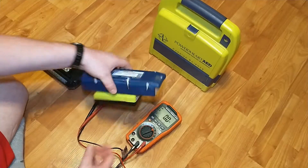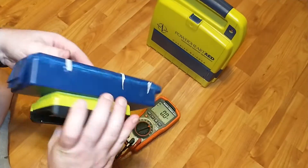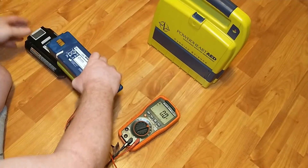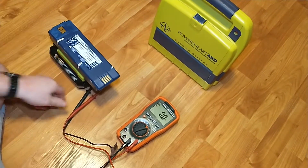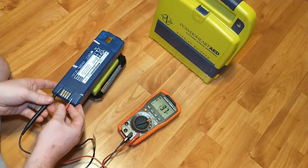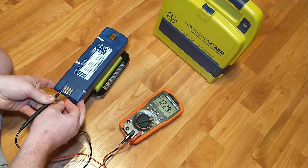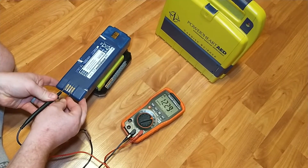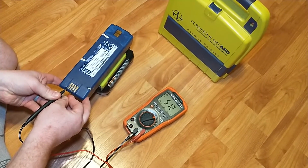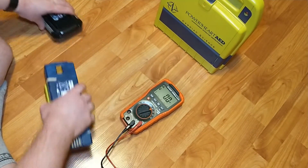I've finished gluing — it's all put together and wired. I tested it with my gauge set: connecting ground, it reads 12 volts — actually 12.29 — and the 5 volt side reads 5.12. That all checks out.